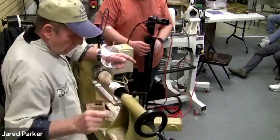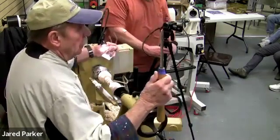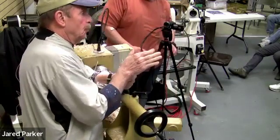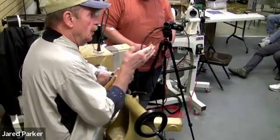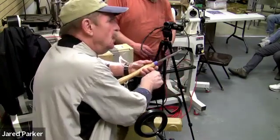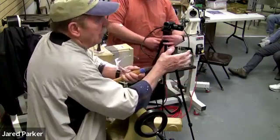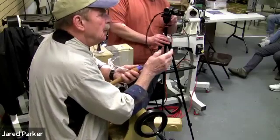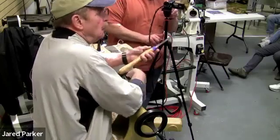You've got to be careful about sharpening the tool. On this captive ring tool, yes, you sharpen towards the center on both sides. Follow that same angle right here. I have a CBN card file, and I just hold it up there and do that. It doesn't take long if you stay on top of it and do it periodically. And you can tell when it starts getting dull. It'll start getting burn marks on your piece, and you just take the card tool out and sharpen it.